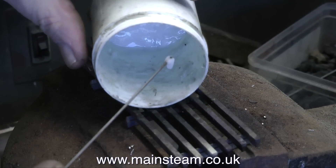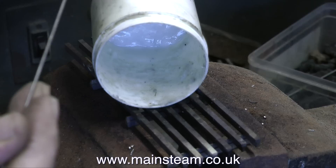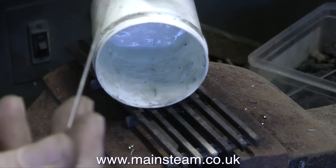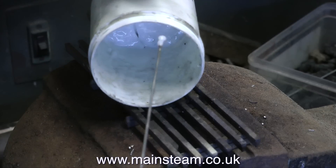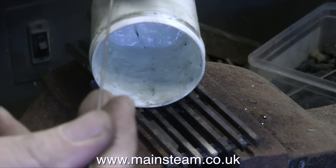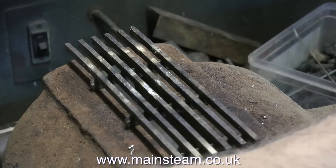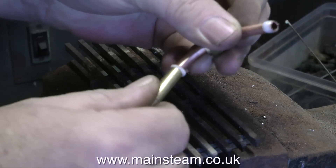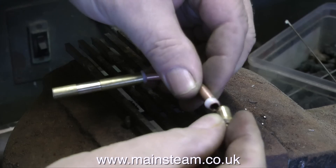You can see the consistency that I would mix the flux powder to — quite thick, almost like thick cream. I generally apply it with the silver solder rod itself. Ordinarily I would have shown the application of the flux to the work, but in this case I was such an incompetent cameraman that I forgot to move the camera. But you can at least see the pot of flux and you can see me picking the flux up from the pot. Now you can see the off-cut of stainless steel model locomotive grate that I used as a silver soldering surface — you can use fire brick, which is probably better, but this works. Here you see the flux that I applied, and now I'm fitting the parts into the fluxed area of the copper pipe.